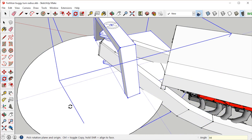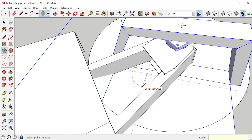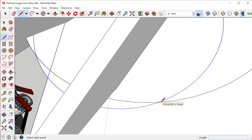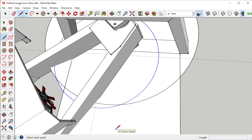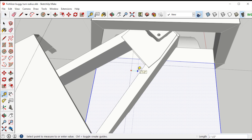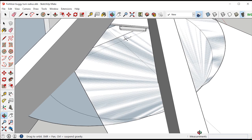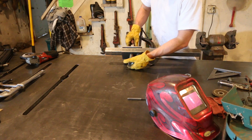Next I could leave that circle where it was and rotate just the wheel to the other extreme — all the way left 47 degrees — and draw a new circle from the same point representing the cylinder all the way retracted. Where the two circles intersect are places where the cylinder could be mounted and it would give me that turn radius. Mounting the cylinder in the first position obviously wouldn't work because one intersection is outside the frame and the other is up on the left side, which wouldn't give the cylinder enough clearance underneath the frame. I kept trying new mounting points by moving the front point left and right and eventually came up with circles I thought would work really well — just right on the inside of the right frame.